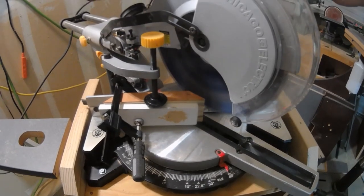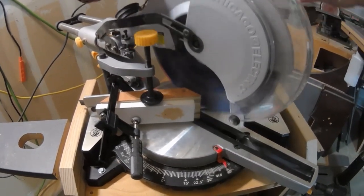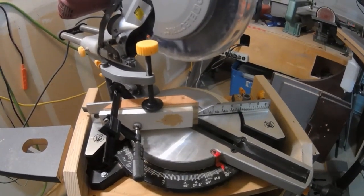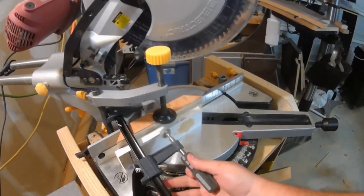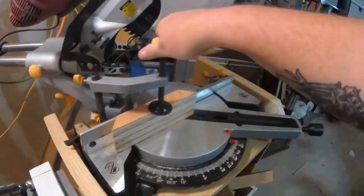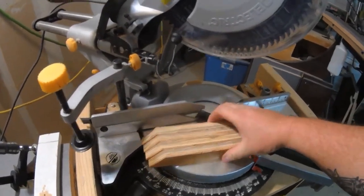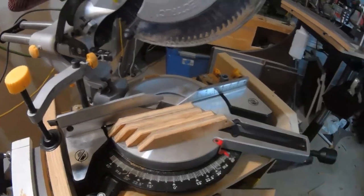To help steady the box and give it some tension, I've got four tab cuts — I'm not sure what you'd call them — done on the old sliding miter saw. I stacked them all up together and did 45-degree cuts on either end. Those go on the bottom or base of the box to give some resistance and rigidity to the frame.